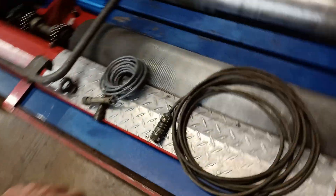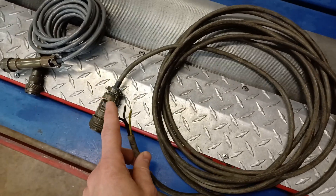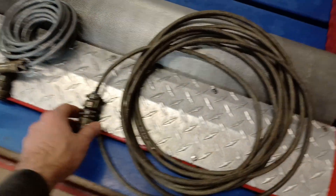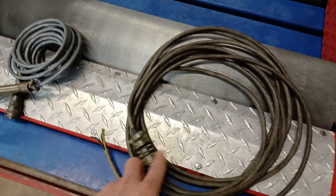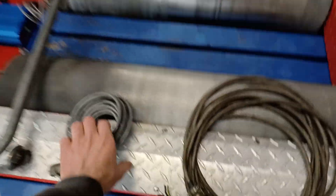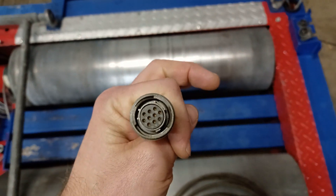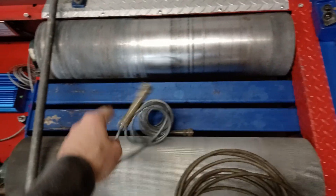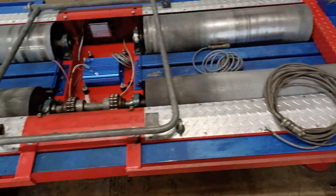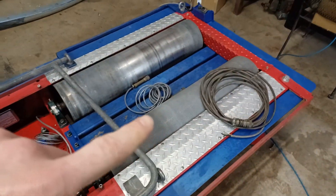I did make my power cable. This is the cable that will be from the mains — of course this is plugged into the wall. When this is plugged into the wall, you just want to make sure you got your gender correct here so that you don't have the male pins sticking out where there's a potential that they could be shorted. Just remember to have your pins properly arranged so that the power is always protected going towards the wall. This is going to be my signal cable — this will plug into the other 10-pin connector that's going to go there. This is actually going to interface back to the dyno cabinet, providing all those signals back to the YourDyno controller, which I'm still going to use in a cabinet.